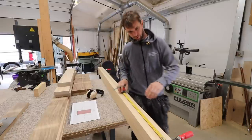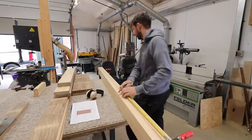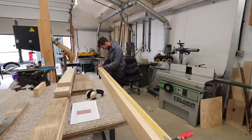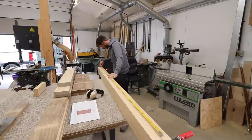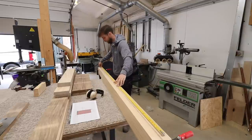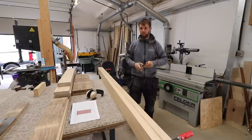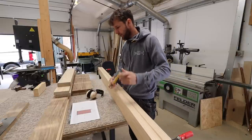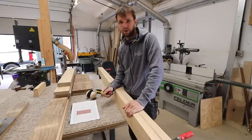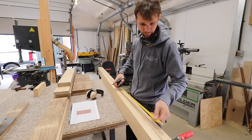We've got about 70mm. So if we would mark off for 30 and add that on at the other end, 47. Just double check that off the end of the tape, like always. 2017, 2017, perfect. I've made this frame in mind with the sort of standard door height underneath the door stop there, so we know we're going to have a decent clearance of any internal doors through this side gate.